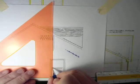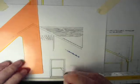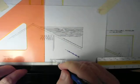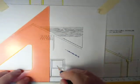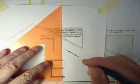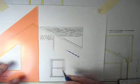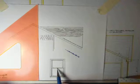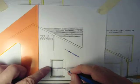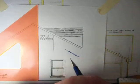So you've got a portion that divides the top double hung from the bottom part of the double hung, and you're going to draw these around. I'm skipping measurement, but measure each one of these about 2 inches. I'm trying to do this in a hurry, in interest of time, and as you can see I got off a little bit, but measure each one of these to about 2 inches. Now you'll notice that the bottom part of the double hung, this part on the inside is what would go up behind this. So this line would be all the way across here in your double hung, because there's actually another part that looks like this just right behind it.